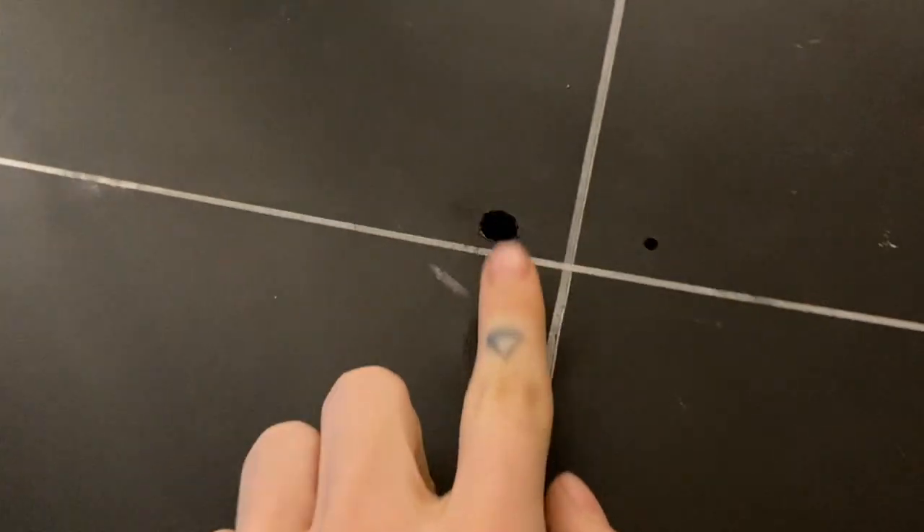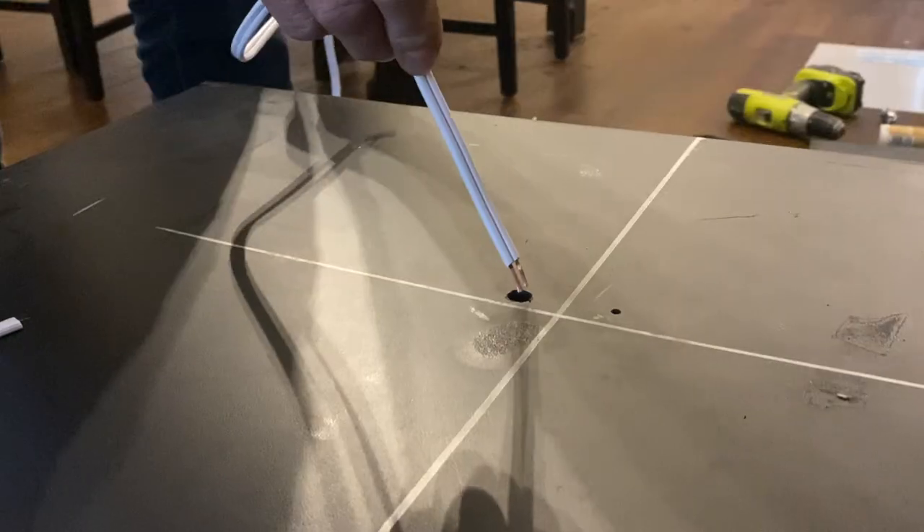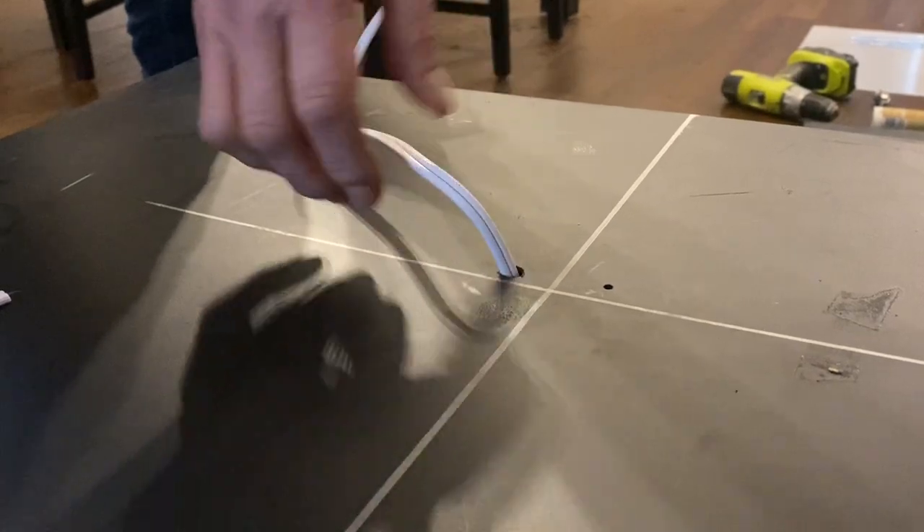Now for the actual building and assembling. First we drilled holes on top of the PVC enclosures for where the wire will come out. One appropriately sized hole per lamp holder is all you need — I have two holes here because these enclosures are split down the middle. Then we took the wire with the plug and switch and fed it through the hole so that the plug and switch are on the outside of the enclosure.